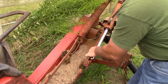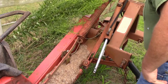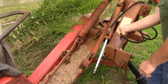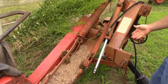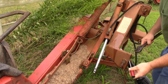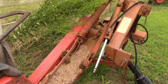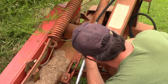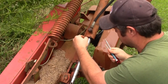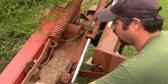We need to push this part back, and if there's hydraulic fluid in here you've got to release that pressure. Just take your hammer and hit the quick connect to release the pressure — you may have to do it more than once. Then with a wrench and a screwdriver, tap this piece back up in here just a little bit so we can see the locking ring. There you go — that's basically what it is, just a little round locking ring.